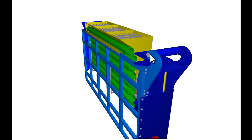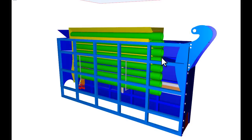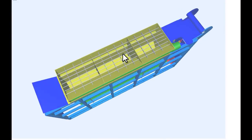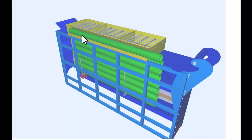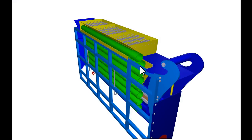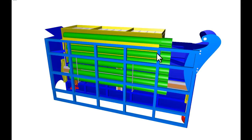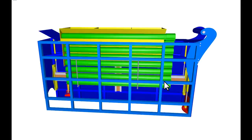This arm, the pole arm, fits inside your bucket. You can see how it's skinnier in a ditch. We have a stone hopper with a grill on top to keep big dirt out. We can handle up to 5 inch through the holes of the stone hopper. This model handles 4-inch or smaller, actually, but 4-inch to 8-inch sewer pipe, Schedule 40. Basically bell and spigot pipe.